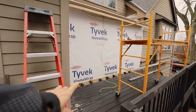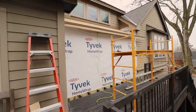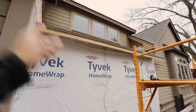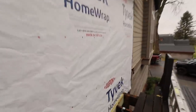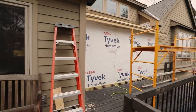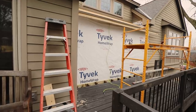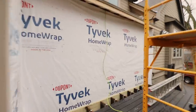So out here, I'm going to get these joist hangers put on so you can pull the temporary support out from here and be essentially done with this area for now. I have the hangers out here for the deck to install, and then there's all the hangers for the rafters inside. Those aren't as critical because they can be done at any time. I have one box of nails, and how far I get with that is as far as I'm going to get. Next week, we're going to be working inside. We're going to start removing the staircase, so Donovan's going to be prepping for some of that. He's down in the new basement getting things ready for that. So I'm going to slam in some nails, and then we'll go see what Donovan's up to in the backyard.